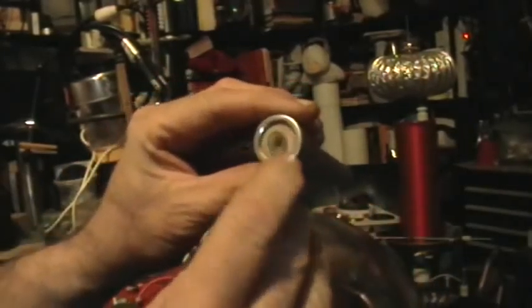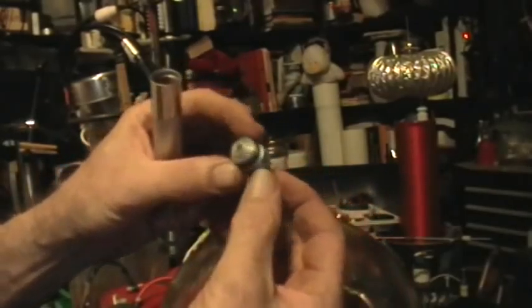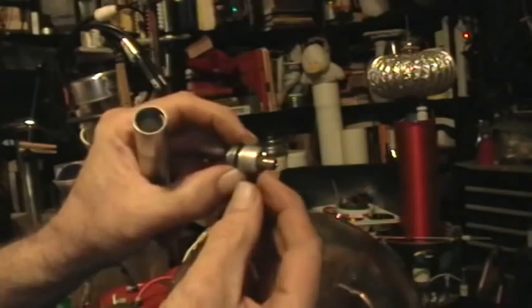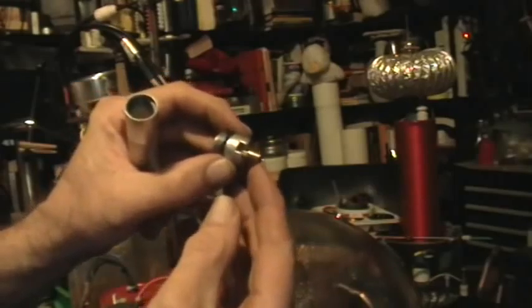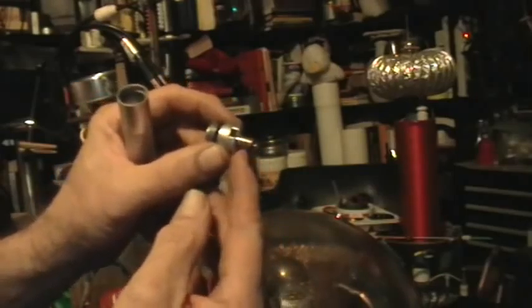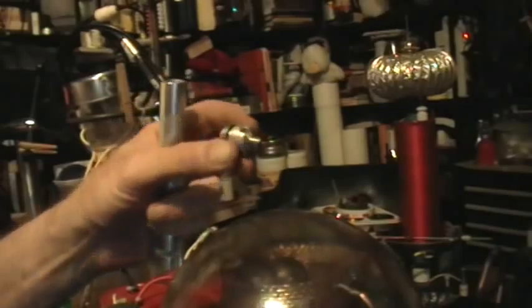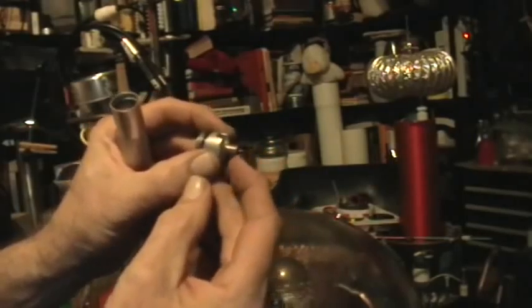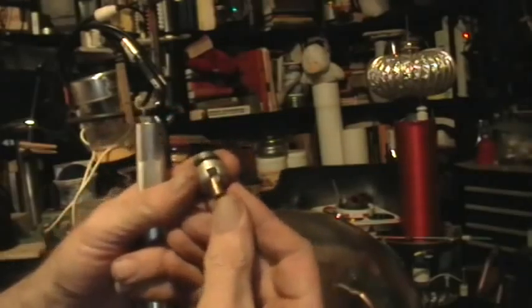The barrel has to be glued to the inside of the cork, and then on the other end of the flashlight, you just take all the guts out of the flashlight, and you take the end cap and drill it, and then use a standard car tire tube valve stem with all the rubbers stripped off. I just went down to the local car store, drove around to the back and picked up a handful of these things. They cut them off and discard them when they change tires. All right. And then I filed it down just a little bit to make the valve pin proud enough so that it would be easy to actuate, to push to both fill and trigger the thing.